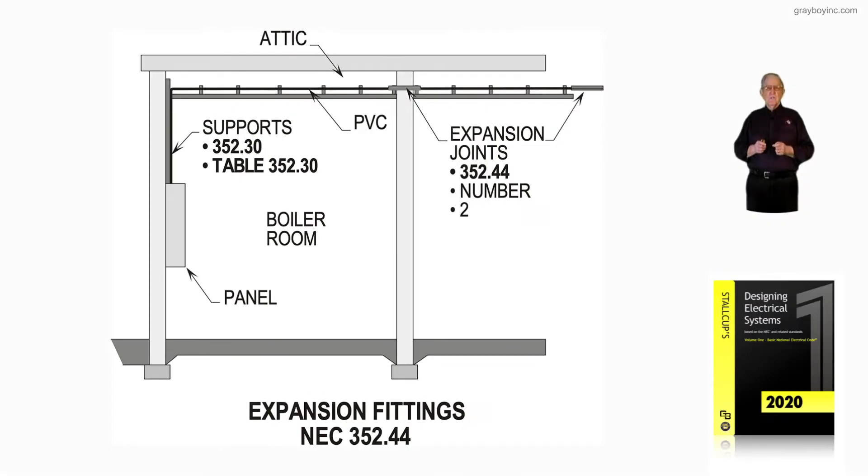This illustration deals with marking in accordance with NEC 392.18H exception. Notice if that cable tray is down low where people can get into that tray and it's of a high-voltage nature, then label marking shall comply with 110.21.